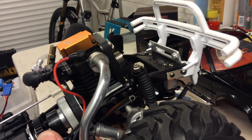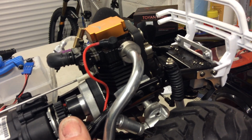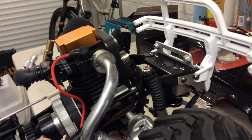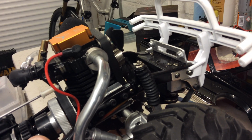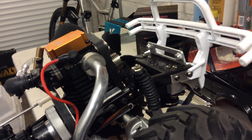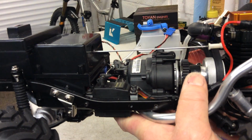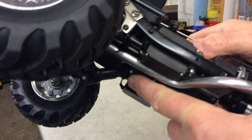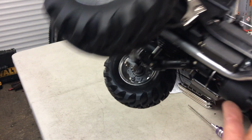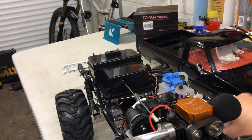I'm gradually getting the hang of that welding. You have to get the metal, or the alley, fairly hot, not too hot, and when you touch the rod on there, nothing happens, and you think, oh, it's not going to solder. But if you just leave it on there for a little while, all of a sudden it runs round. It's a bit of an art to doing it, but it saves you so much work and time. You can just put that on there and weld things up, and it makes life a lot easier. So that's kind of where I am at the moment.